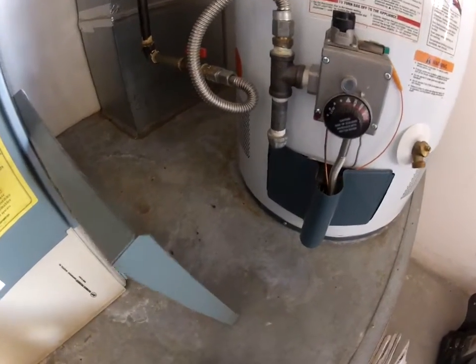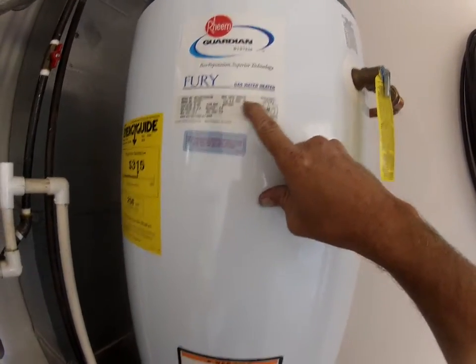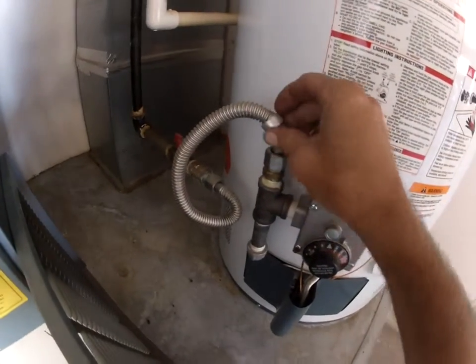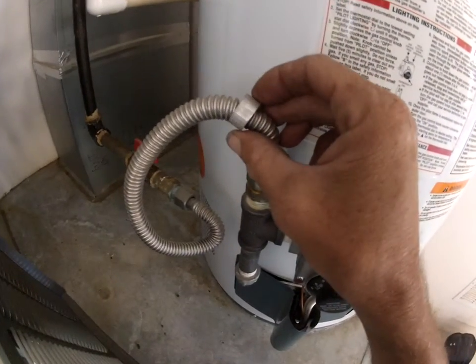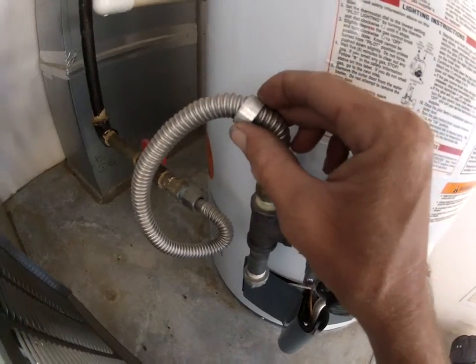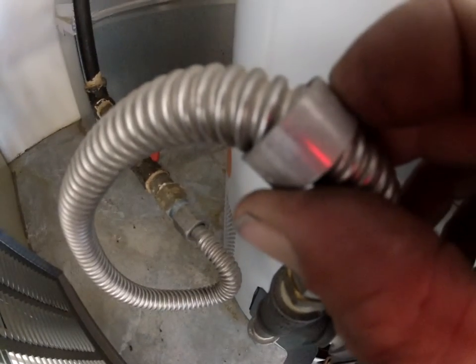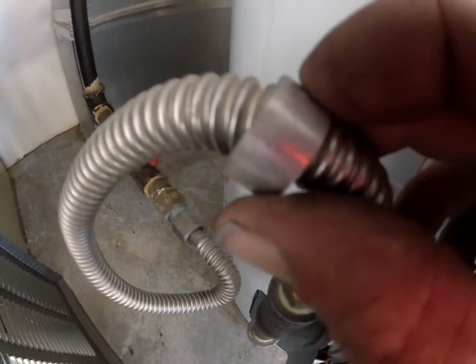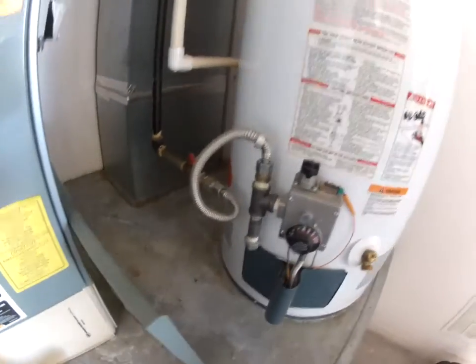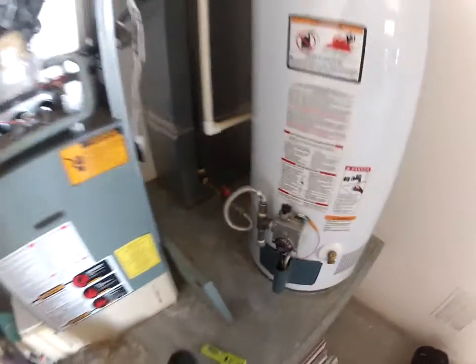Okay, let's see if we can figure out what's going on here with this water heater. Manufactured 9 of 2010 — in 2010 they weren't using gas rings. What is the date on this one? This is 86 — 1986. That's a single-use gas flex, not to be reused.